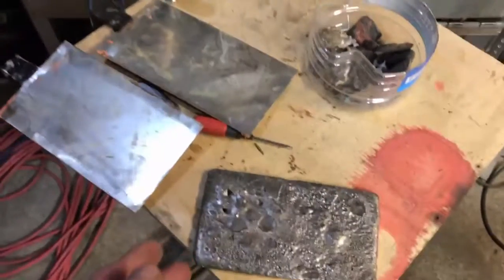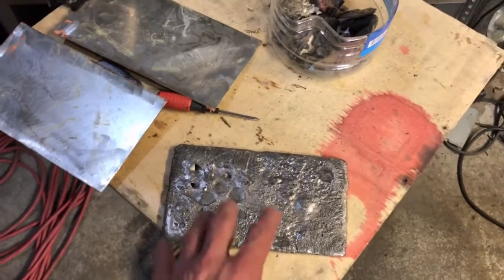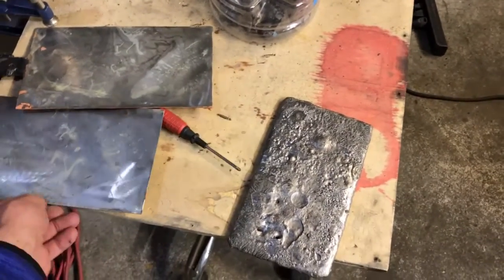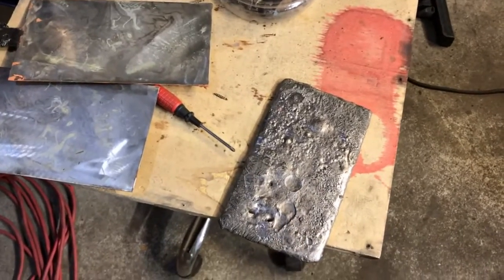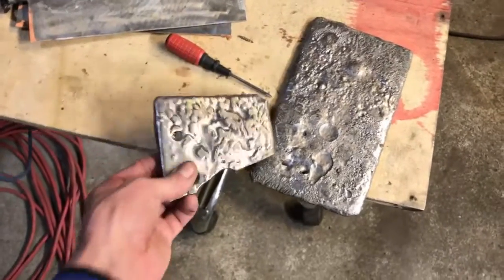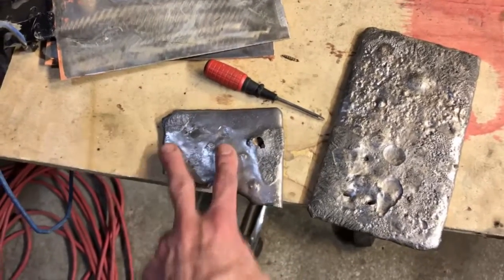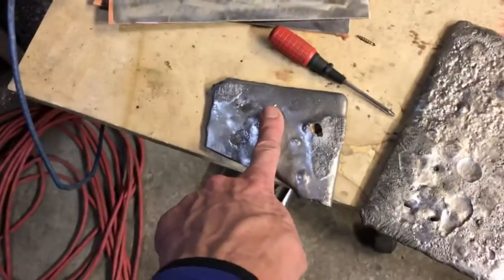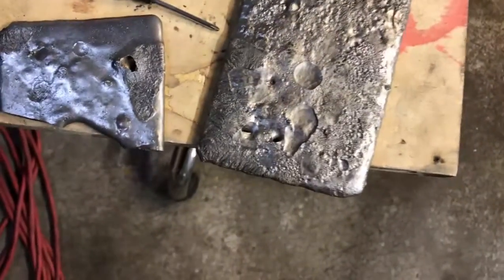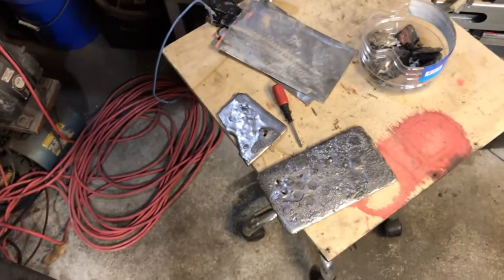However, because our primary goal is simply to harvest some more anode mud to do experiments with, I'm going to forego shaving this down — just to illustrate what not doing so looks like. We've got this other smooth one here that's a lot smoother because I used a different flux recipe, and I do have all of that logged. You can see this is a far better recipe — this other one was still boiling quite a bit. That's going to be covered in the next video; we're probably about a half hour into this thing by now.